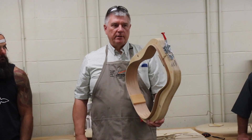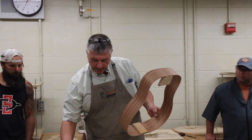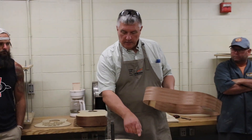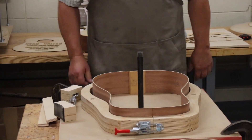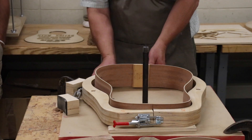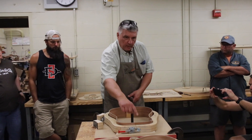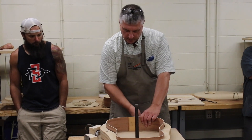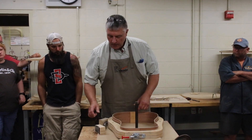Otherwise you're going to spend a lot of energy on that. When you do this, you have your piece on here — this thing was an hour in the clamps. Bring it over here; you can do this on a workbench. I'm going to put the bottom in first. Notice I don't have the pins in, so I'm going to open up one of the ends, place this in here, press it down, stick one of the shims underneath, stick them on the other side, and then when you clamp this your hope is that the center is in the middle of where the clamp is.